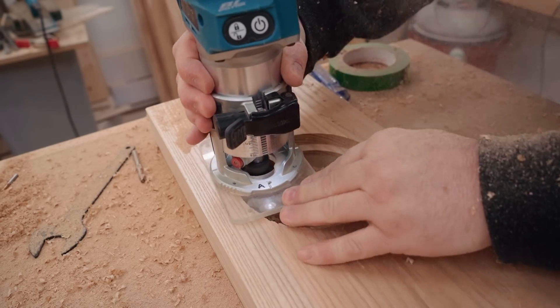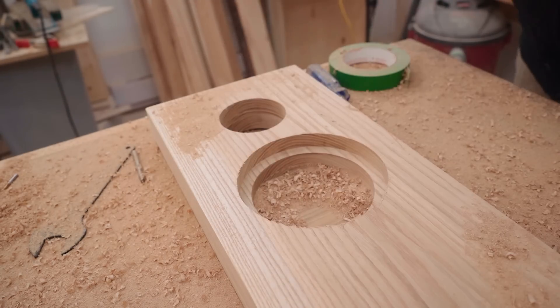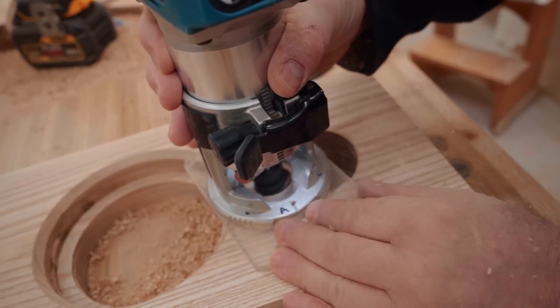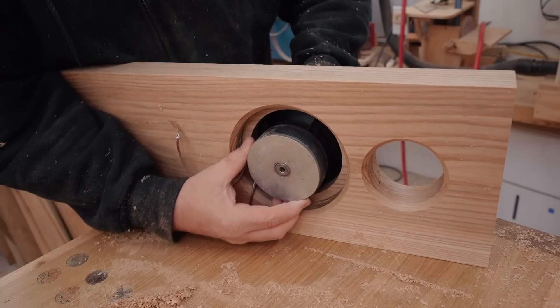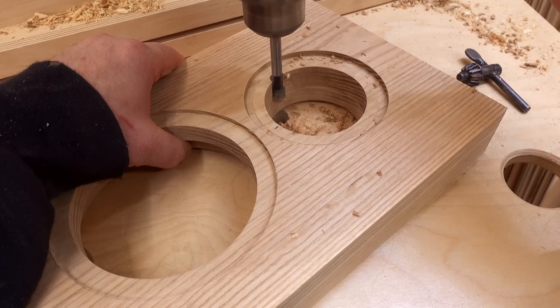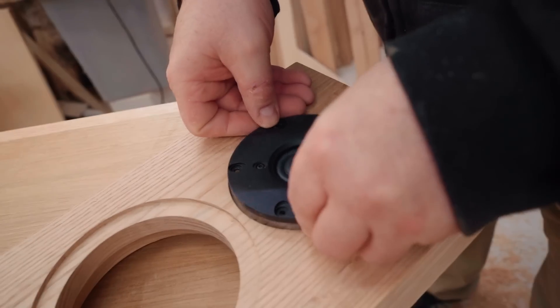What I'm doing here is making the back of the hole bigger for the woofer. That's because this is really thick wood and it'll give it a little more room to breathe. Then when I have that done I can switch to a chamfering bit and run it around both holes. You can see here how the woofer fits and the clearance it has on the back. I also need some clearance for the leads on the tweeter, so I'll mark those and drill them with a 3/8 inch Forstner bit.